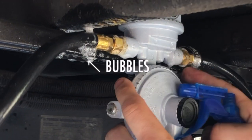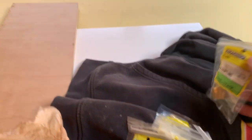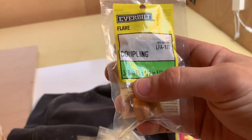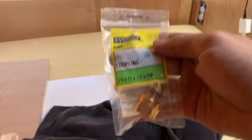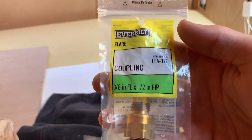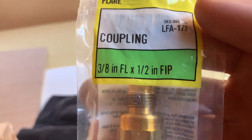These are all examples of fittings that we used — they're flare fittings. So whenever you're in Home Depot looking for your couplings, unions, whatever you may be using, always get the flare fittings — they're all yellow. We either used 3/8" or half-inch. A lot of people said don't do your own leak tests, it's dangerous, and have a professional check it out. But for now it doesn't leak, it doesn't smell when I have the gas on, so I think it's okay, and I'll check it monthly.